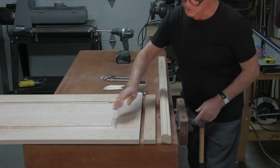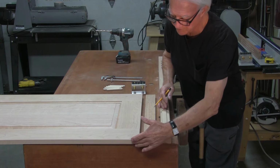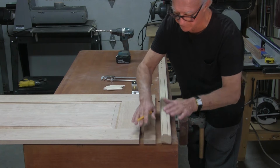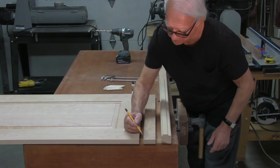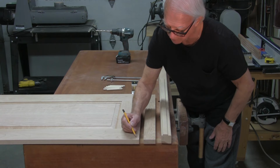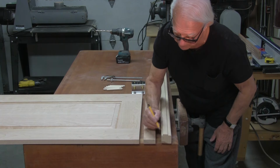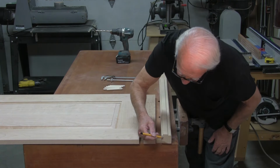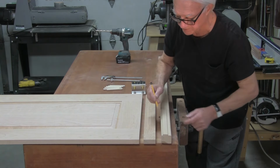Now, as I mentioned, this is the top end here. So these are 3 reference ends, and these are 3 reference faces. Even though they're not on the same level, they're all referenced to each other. So what we start off with is here, check mark 1, check mark 1, check mark 1, check mark 1. Here between these two, check mark 2, check mark 2, check mark 2, check mark 2, and the X on the surfaces are to be drilled.